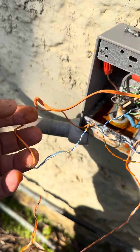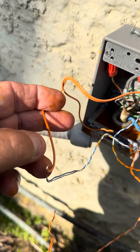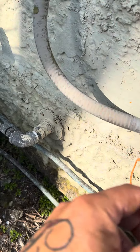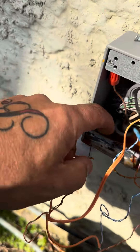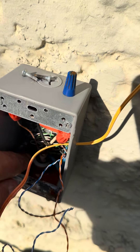Don't run telephone wire when you run control wire — run 18-2. And then this wire here is rotted off. See, there's no ends, there's the wire. It's like jammed in here, can't seem to get it out.